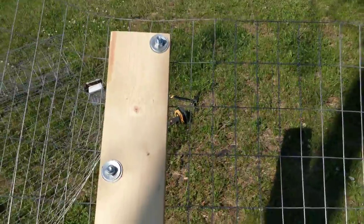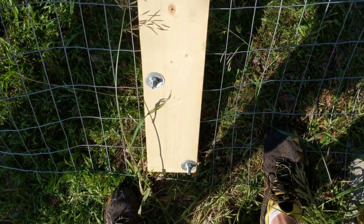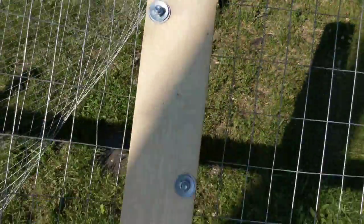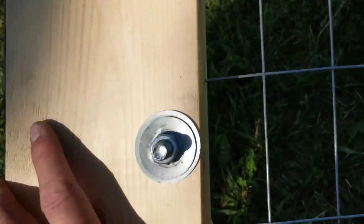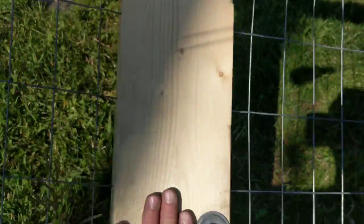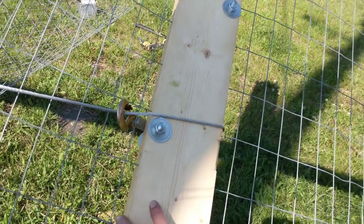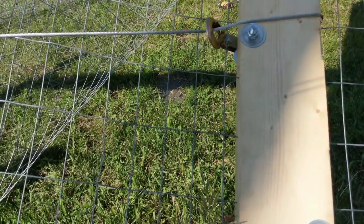What you do is take a two-by-six that's almost the entire length of your fence section — we're doing a six-foot fence but it doesn't have to be. I've taken a two-by-six on each side of the fence and secured it with seven bolts in alternating fashion, clamped down really tight. You're basically sandwiching the welded wire fence between these two two-by-sixes. You can use two-by-fours, but the wider and thicker the board, the more clamping pressure and surface area you get, which makes it stronger.